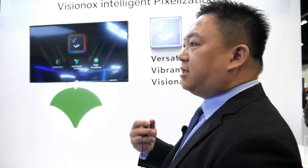How do you optimize the photolithography? Is it cutting-edge photolithography? That's a conventional photolithography process, but we designed a very specific process flow so we can prevent OLED damage from the liquid. We encapsulate all the subpixels first and then do the photolithography. So this is the first time you show this? Yes, that's our first time to demonstrate this technology. In this exhibition, we see similar demos, but our prototype will be the best one, in size, pixel density, and other performance aspects.